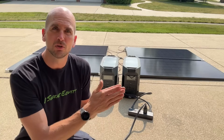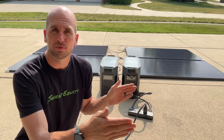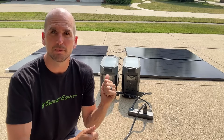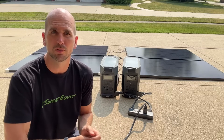You need to consider whether you're putting panels in series — adding up all those voltages — or using a parallel configuration to get the amperage up. It should be noted the maximum amperage on the solar input side is 15 amps for the EcoFlow Delta Pro.